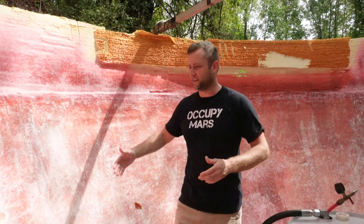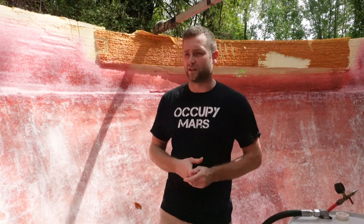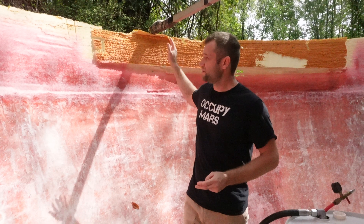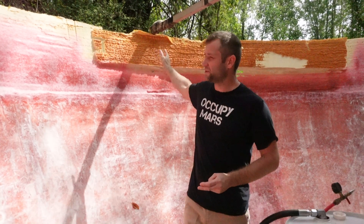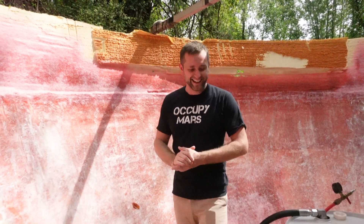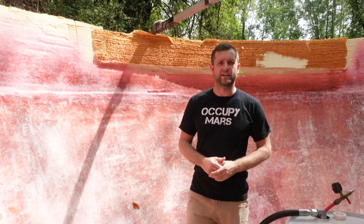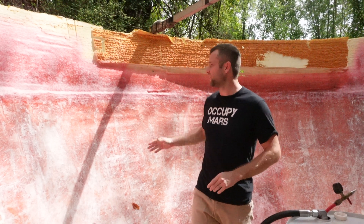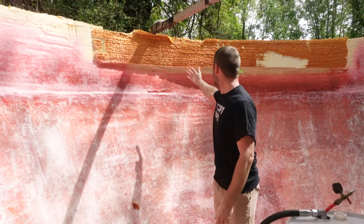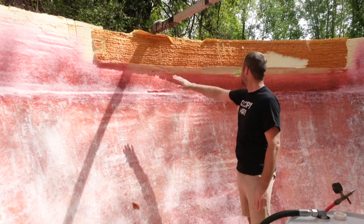With the structure, I needed it to be dimensionally accurate, especially for the following steps to work well. After taking measurements and finding it wasn't accurate, I attached the router to the end of an arm and machined the surface down to be accurate and in the perfect sphere. You can see where it's been machined here. This part still isn't machined — you can see how this is one of the spots that was warped and got pushed in right there, so I still have to machine that out.